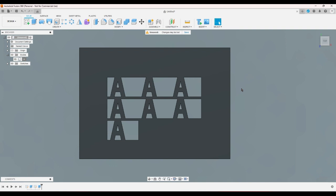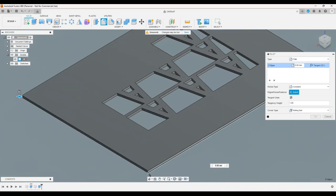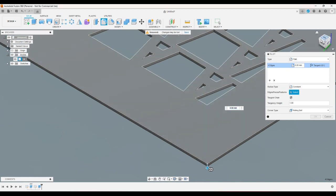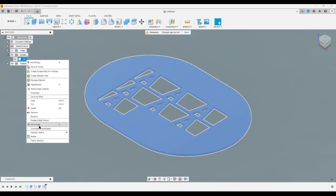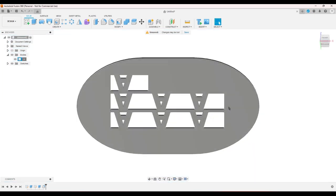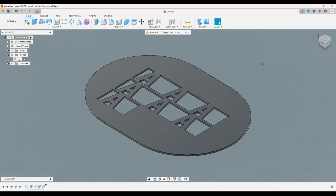But yeah, for now, oh, you know what? I don't want this to peel up because I'm not testing anything. I only want to test this part. So I need to round off these edges real quick. Okay, now I can save it. Yes, replace it. There. Because if there were sharp corners, then it increases the likelihood that it's going to peel off of the printer. And that's not a big issue with something as small as this, but better safe than sorry, you know? So, gonna go ahead and print this out, see how readable it is.